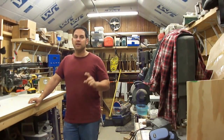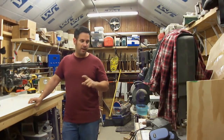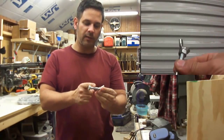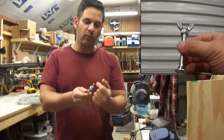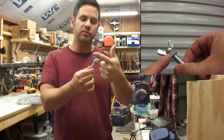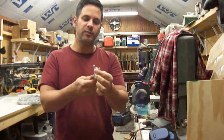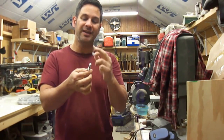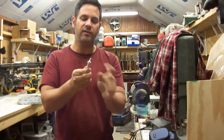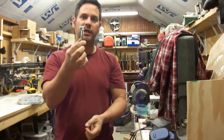One of the things we need to do is think about our spur drive. I've got to drive this thing from the headstock somehow. I'm going to take this carriage bolt, cut it off, and use a wing nut. I'm going to grind this wing nut flat, put two edges on it, and spin grind the point of the threaded portion into a point — so I can have a homemade spur drive to fit in our lathe chuck.